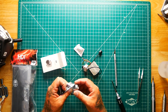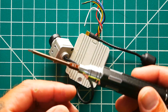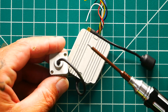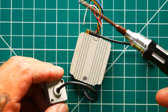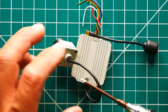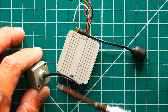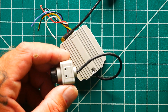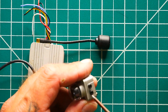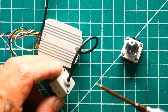Pull out your new camera and set her aside. You should be familiar with a 1.5 millimeter tip — it's very common in FPV drones. We always use 2.5, 2, and 1.5; those are just the common sizes. So if you've built any drones before, you 99.9% have this driver. If you've installed this camera on your quad, then you have this driver — it's the same driver that takes these screws in and out. No worries, don't panic, you've got what you need.